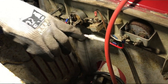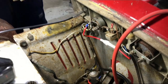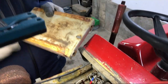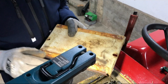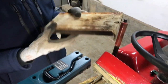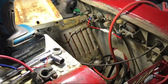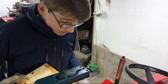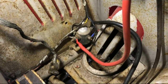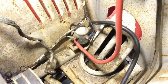Now we're going to put the battery tray back in. We took one of the lips off and decided to keep the front one — so it doesn't affect how the battery sits with just one on, we put it underneath, otherwise it would be tilting backwards towards the steering column. Before we cover it up with the battery tray, we've also put on a new battery cable to the solenoid so that is fully ready.